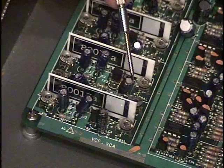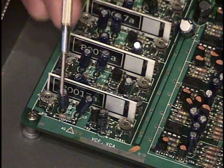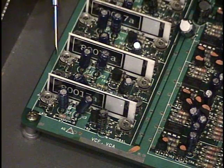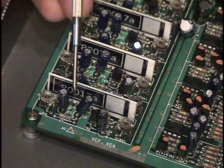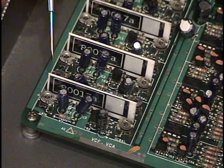By adjusting the cutoff frequency, you can tune that sine wave. We're going to tune all these chips so that the output frequency is exactly one kilohertz for each chip, so each chip will be voiced to sound the same.